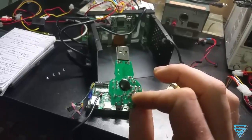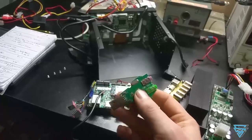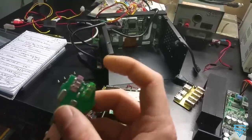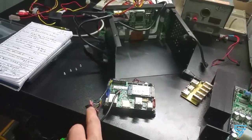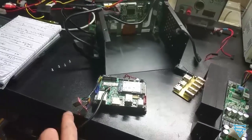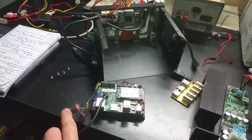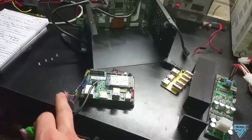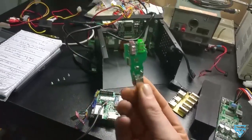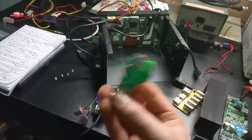But yeah, that being said, it just works. I was not planning on attaching these to the board, but because the input on this thing here was a piece of crap, the one that actually goes in factory into the board has a stereo mic input or line input, so I used that one. This one here has an output too, but everybody knows you don't use the sound output from the motherboard because you always get a whole lot of noise whenever it's making processes. So basically I'm just using this as a sound output, and I'm using the one on board as a sound input, and that's pretty much exactly why I have two.